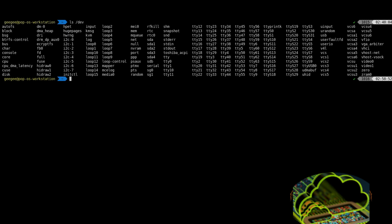And we're looking through our TTYs, and what we really want to look for is ttyUSB. Most of the time, these dongles are going to end up being ttyUSB, and then whatever order, if you have other devices that also use ttyUSB, then you might have USB0, 1, 2, 3, whatever. In our case, we're just ttyUSB0. If you're using a Flipper, I think it's ttyACM0. I can't remember exactly what it is, but it's a little bit different. So just keep an eye out for that.